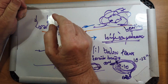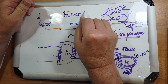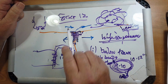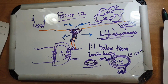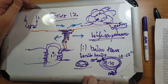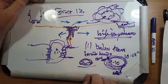I'm going to suggest that you go back to the manual for the Force 12 antenna. They used to be up here in Grand Junction, north of us, but they're not there anymore. The Force 12 antenna, go to the manual and see exactly how it says to feed it. Now, even if you feed it with RG8X, which you certainly can do, it'll handle all that 500 watts.